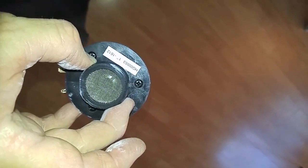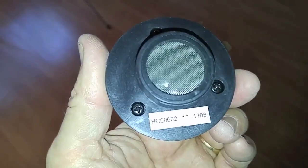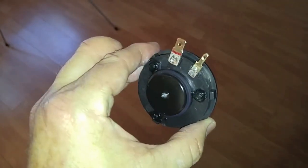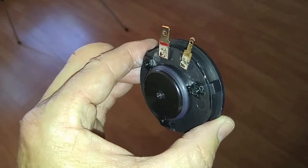Here's the heat sink compound — this white creamy stuff where the heat sink screwed on, and those are the threads where it screws onto the base. This one says it's part HG00553, but when I went on the internet the replacement part has a different number. I don't know if it's an upgrade or they've just changed the part number. The new part number is HH00602 — that's the part Full Compass sent me, and I have confirmed these parts do fit and are almost identical to the originals.